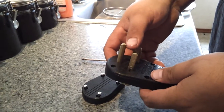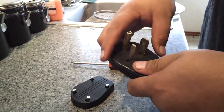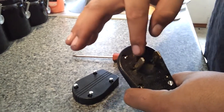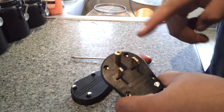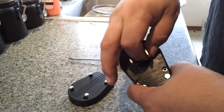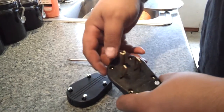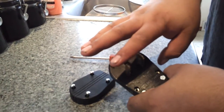It's a NEMA 6-50 plug and it's a universal plug. You're going to see that these two prongs can either go vertical like this, or they'll have a horizontal setup where they're in line like this, and you actually have two fat ones versus a fat one and a skinny one. When you run them horizontal like that, that's a 30 amp setup.